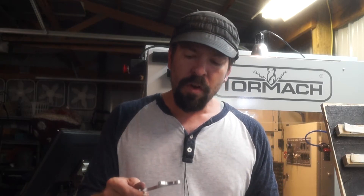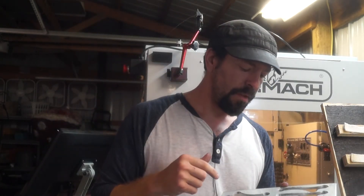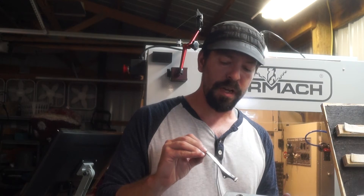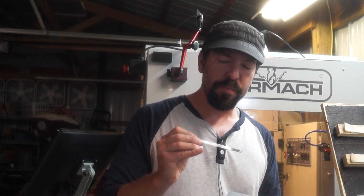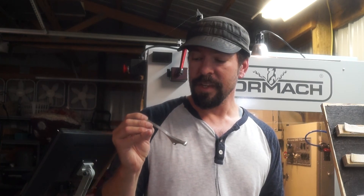I just plowed through those super fast and that's not the optimal way. If I was going to mass produce them, I could cut them rough like this and then make soft jaws to clamp them in and face and bevel them, or take the whole sheet, pre-drill it, pre-face it, bolt it down onto a fixture, and cut them — I think I'd get better results that way. But the point is these are rough and not done the optimal way; I just needed to get them out of my system instead of turning my gears forever thinking about the proper way. Next step is to build everything that goes around this — I'll see you next time.